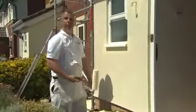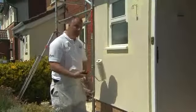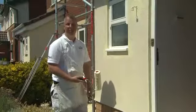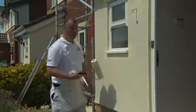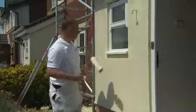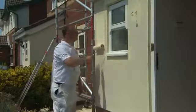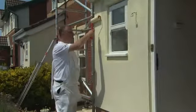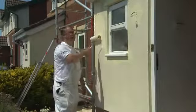I've cut in now using the brush, so I'm going to use the roller to get the large surface area done. One important thing when thinking about rollers is using the right pile. In this case I'm using a medium pile, which is ideal for this fine texture on the surface. One problem you sometimes encounter with a roller is getting spatter on your face. What I'd suggest is putting pressure on the upward stroke when the roller is rolling into the surface, then easing off on the way back — that will reduce the spray on your face.